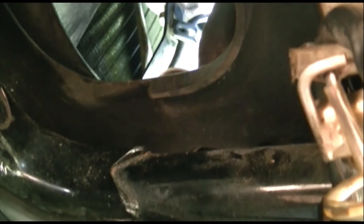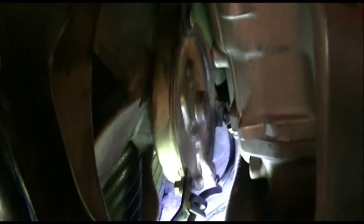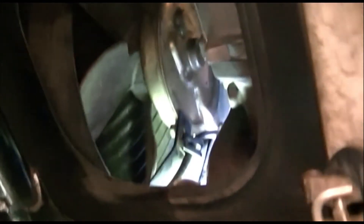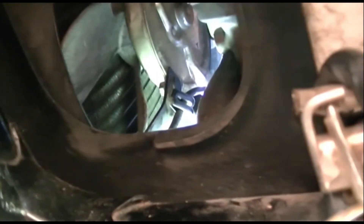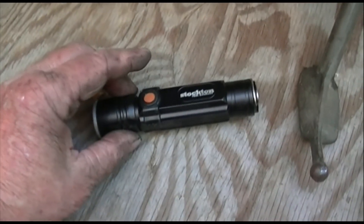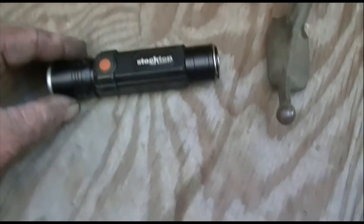When you're all done in here, don't forget to take this little fan wire and put it back in its clip. Make sure you haven't left any tools in there — like the flashlight that's illuminating this right now. Take another look at your hose and clamp. I'm going to reach in there and give a good yank on it just to make sure it's solid. It tilts the whole bike and it hasn't pulled off, so it must be okay. Now we're going to put coolant back in the motorcycle, run it, burp it, and check for leaks. It's a handy little flashlight I got on sale at Cycle Gear for 12 bucks — it's got a magnet in the end and a light on the side.